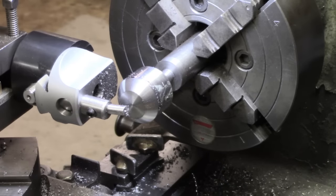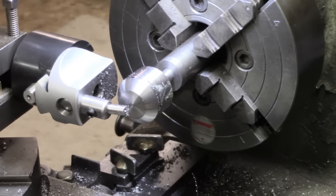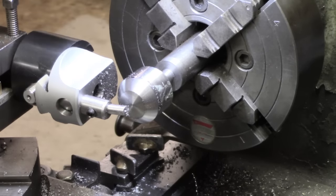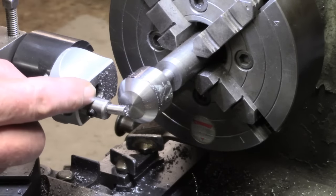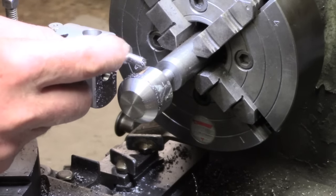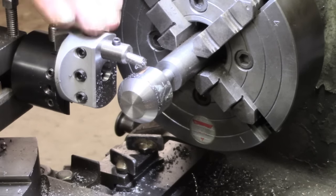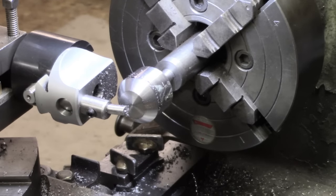All right, I'm not getting a lot of improvement. It's partly the speed and feed situation, and I'm probably being a bit fussy at this material removal stage to expect anything like no chatter, but it's annoying that I'm getting it. I think I might make a new tool holder for this, bring it back in further and drill straight. I've got this offset on here, which I don't think is helping matters, because it's making the dovetail come further out, and I think I can still get my swing with a straight tool. There's something else yet to try, but I'm going to try and finish this off. Well, I think I will. I may stop halfway, you never know.